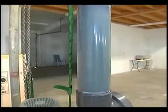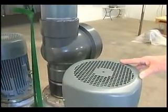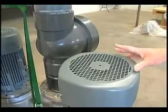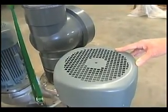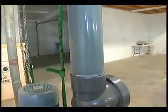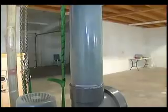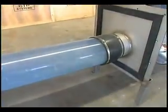After about five reverse rotations to attempt to clear itself and then back to normal rotation, we are now maintaining the flow level of 0.9 feet of head, running at about 27 to 28 hertz and just about 10 amps.